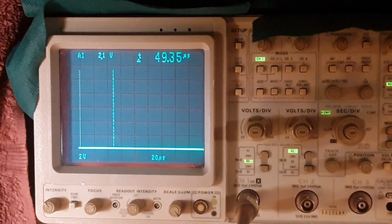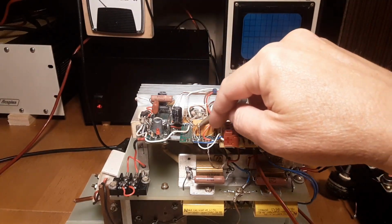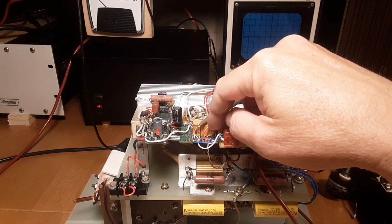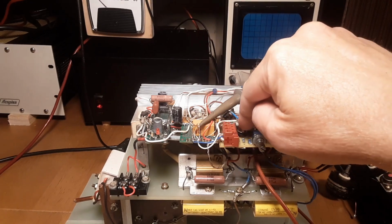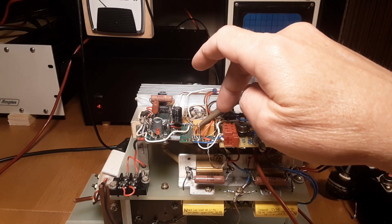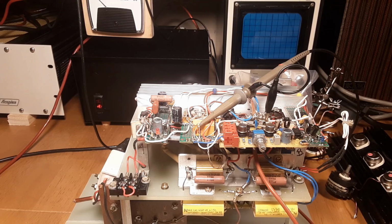That's very weird. The gate drivers are set back here, so all this signal does is go through that relay. Either that relay's on or off, depending upon what the voltage is coming into this. So the relay's just a break between this astable and the gate drivers back there. So we lose it at the gate drivers, and of course we lose it here coming out of this astable board. So why would that be? How could that little spark be shutting something down? That's the $1,000,000 question. And why did it not shut down before? Why did it run before?